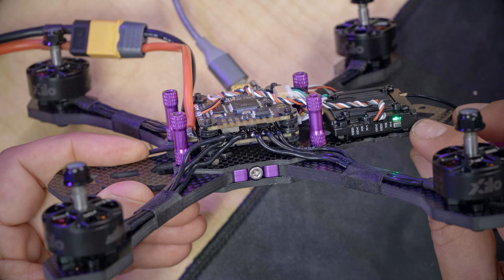Start typing the word avatar in this search box and you will find OSD for FPV WTF DJI03 Avatar HD. That's the one you want. So we're gonna go ahead and click that, and then we wanna open up these options and make sure that the map to display port and set HD OSD options are on. Just take my word for that now, we want that.